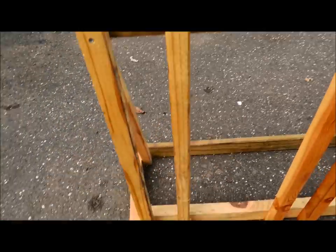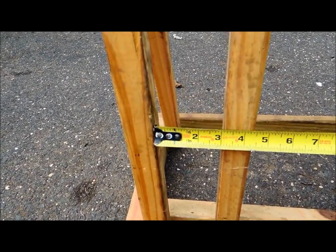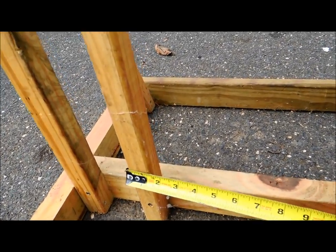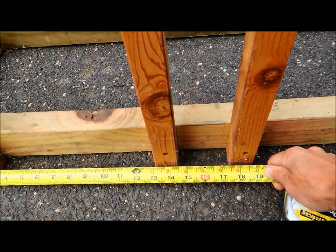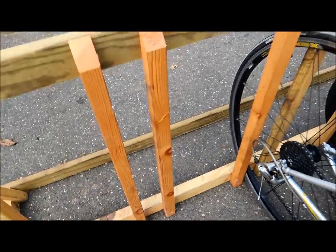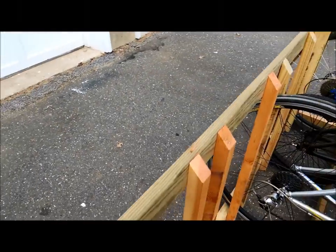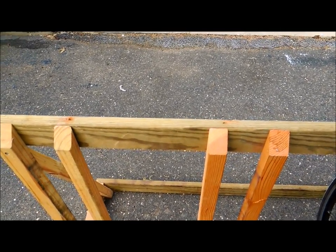The other very important dimension is between the balusters — you need enough space for all size tires to fit. What I have here is just about three inches between the balusters. The centers are at 16 inches, so between each grouping there is 16 inches. In this particular case I have room for five different bikes and the total length is 69 inches.